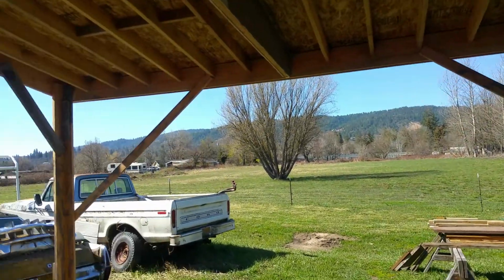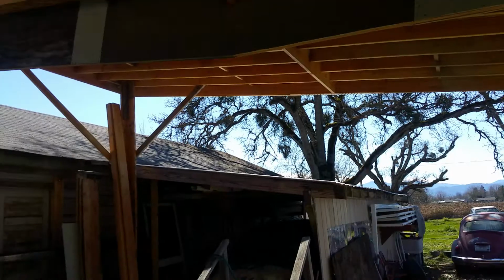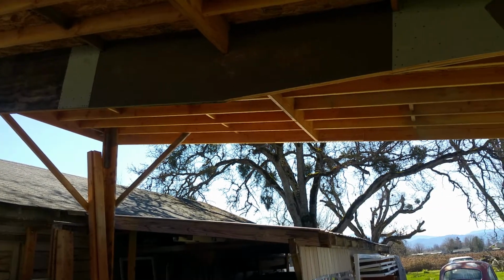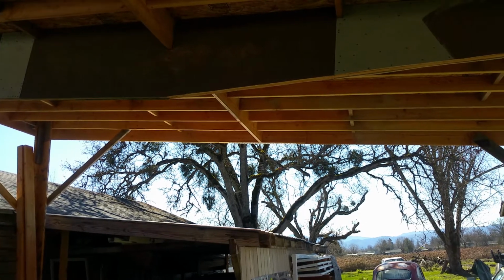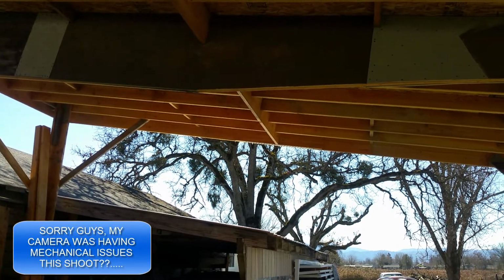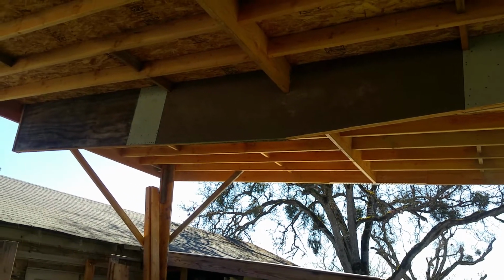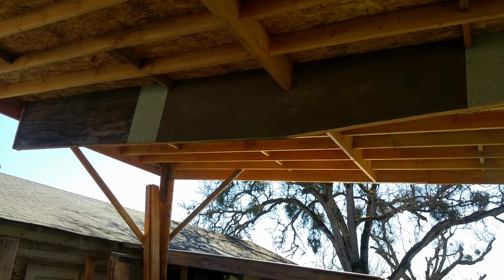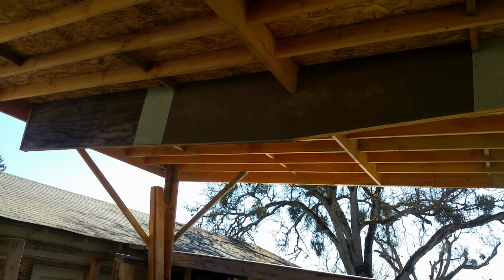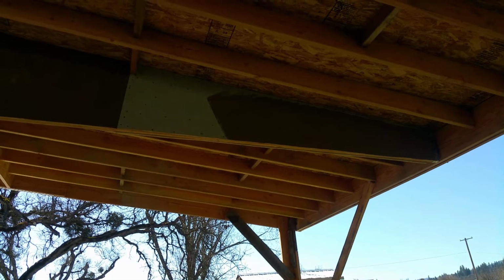And then lastly, the roof was sagging pretty severely in the middle. And so what we ended up doing is putting this beam structure in right here. Hopefully this video isn't jumping like it looks on the screen here. That beam right there is an actual constructed joist, meaning that inside there are 2x4s that run at 60 degrees, forming equilateral triangles all the way down until it started to get thin down here at this end on the right hand side.